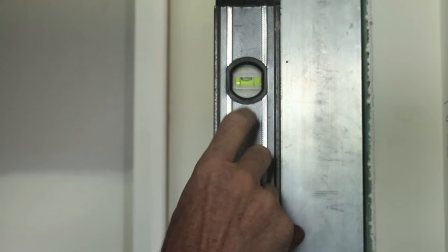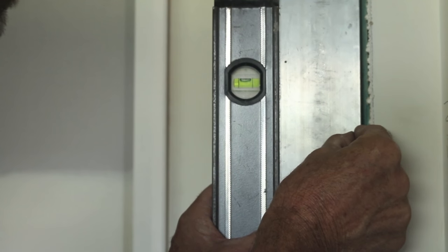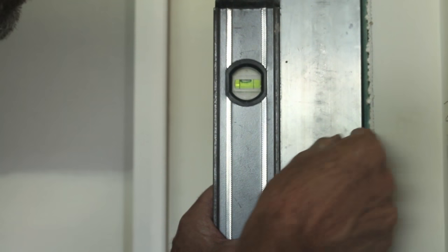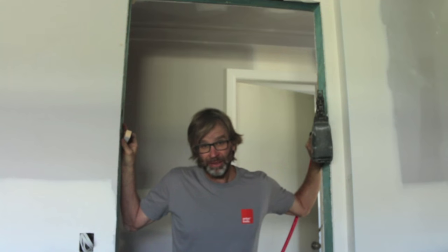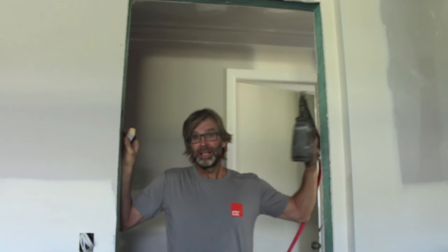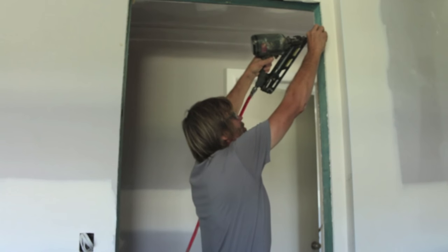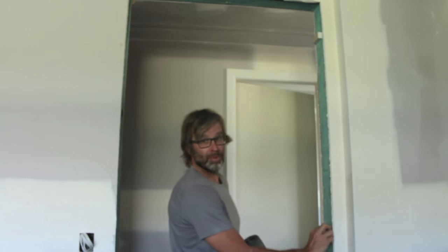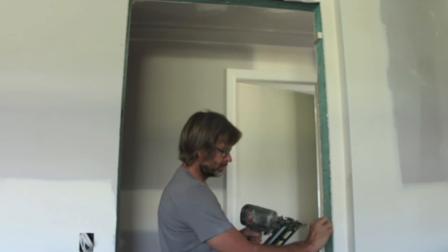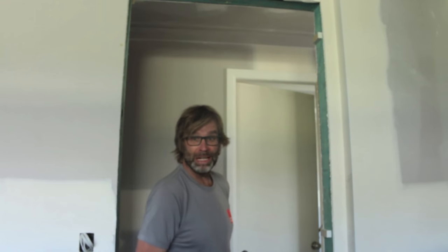So my stud is actually pretty good — it just has to go across a whisker at the top, and that'll be spot on. Now my doorway has about 30mm clearance once the door jams have been put in. So to bridge that gap a little bit, I'm putting in these blocks. So one up the top, one around the middle, one down the bottom.